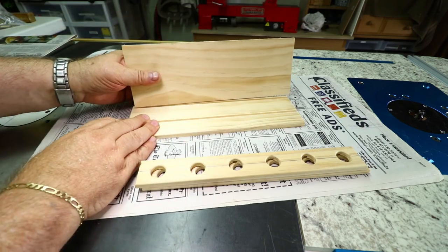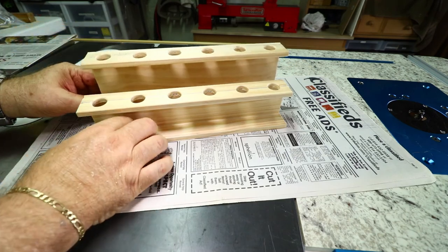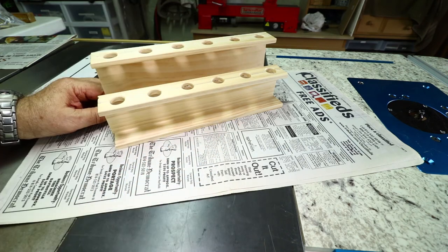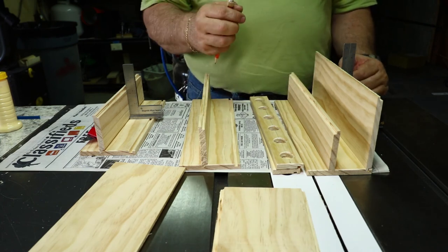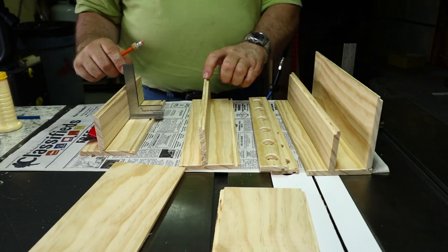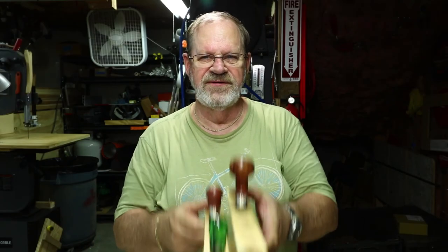The backboard goes in like this into the tongue and dado slot, the vertical goes into its slot, and the rail goes up top to hold the stoppers — once it's all glued together it holds together much better and will be more stable. Each rack holds 12 stoppers. I glue these racks together, putting in the long back piece and using a square against it to hold it straight since the parts can shift a little. Some joints fit fairly snug and stay straight; others need a little support to stay aligned while the glue sets.